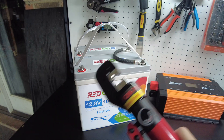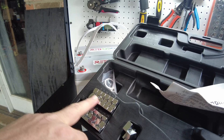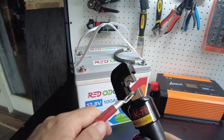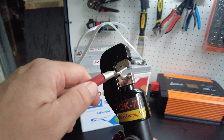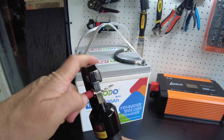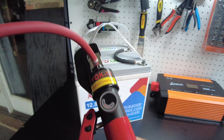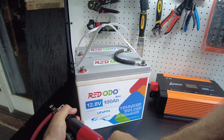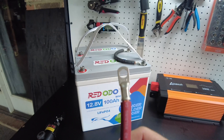I'm using these hydraulic crimps which are super affordable — I'll put the link in the description. They have all the different dies to crimp different sizes, and this one was less than $40. You just pump it up a little bit, get your wire in there, then crank it down. I usually get some leverage on a table. That makes a very solid crimp.